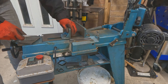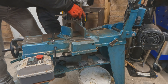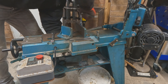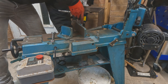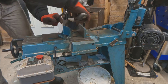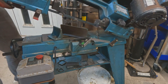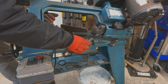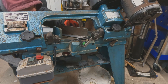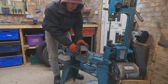Over to the bandsaw — what I'm going to do now is adjust the vice or the clamping section to cut material at a 45-degree angle. This is one of the areas I want to improve on the actual vice, because all the fixings are a different size and not very easy to get to, so I want to make something more easily adjustable. On the side of the bandsaw there's actually a gauge for aligning the vice to whatever angle you want to cut, but it is just a sticker and I'm not fully confident in its accuracy. So I'm using the 45-degree angle itself with the blade just to measure it up — that's another improvement I want to make to the bandsaw, but that'll come at a later date.